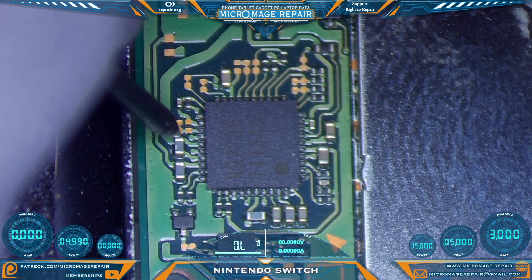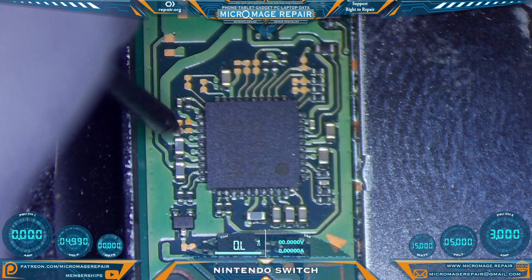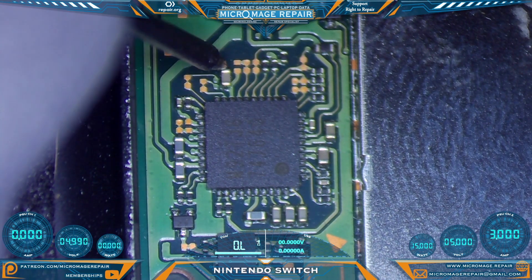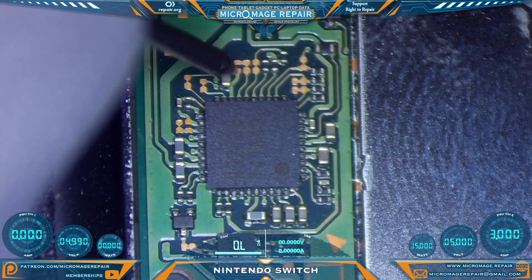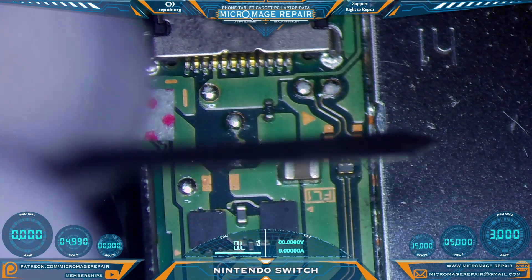This capacitor right here has two lines going to the chip, so one side will always be ground — as long as one side is ground, you're good. Let's check our CPU capacitor; if this one is short it's usually not good news for the device. And let's test our mosfets.